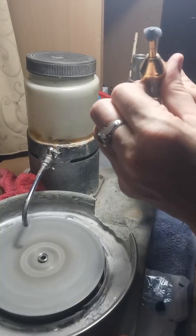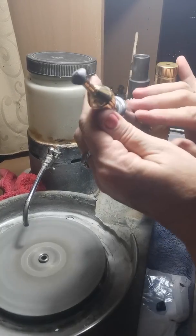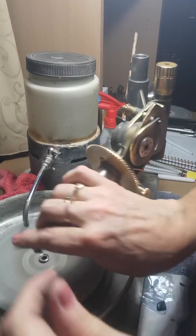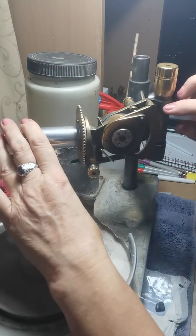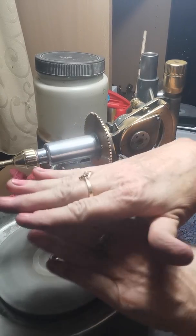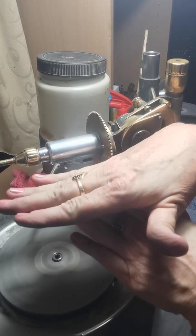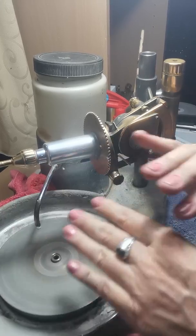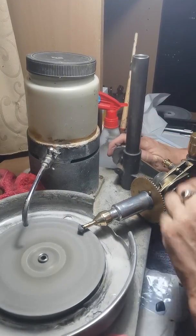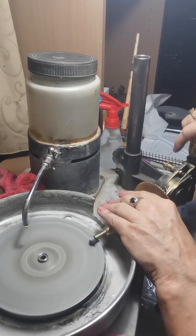After a bit of coning, I'm going to do a bit of rounding — I'll change the angle to just above 90. It depends what machine you've got, but if I go just above 90, then when I actually do the girdle I'll just bring it down half a degree or a degree. Now we're just going to do a little bit of rounding just to make sure.